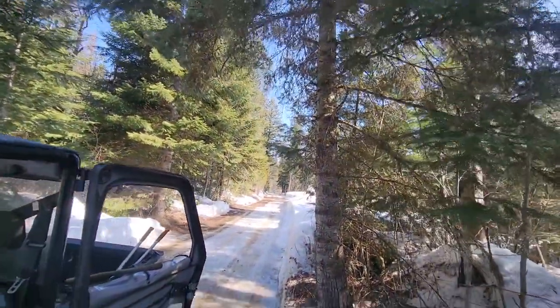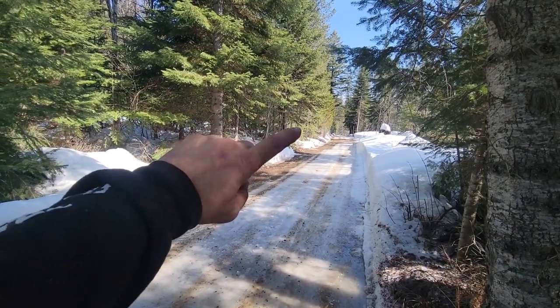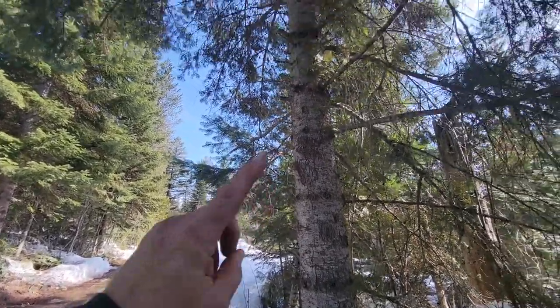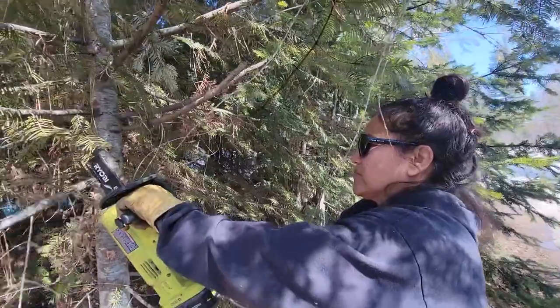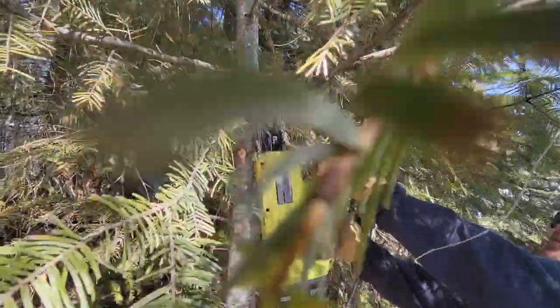We've got all these trees limbed up a little bit. The more you limb up these trees, the more the sun is able to hit the road and dry it out. We're facing east right now, so this is the south side. This tree is going to constantly shade this spot — that's why it's just a big ice block right here. But you can see where the sun is actually hitting, it's melting off really fast. Maintaining your own road — I was plowing this thing with the skid steer all winter long. If you keep your roads scraped down to the bare minimum, then when spring comes, the mud season is a lot shorter because you have less water on the road, and the sooner you get the sun on the dirt, the sooner it dries out.